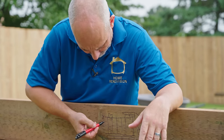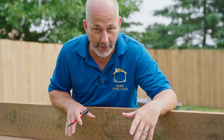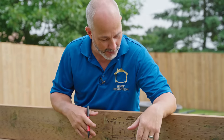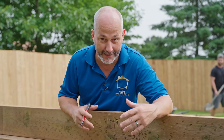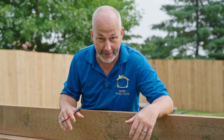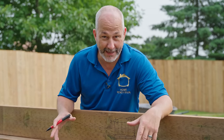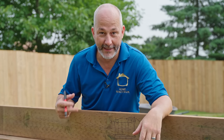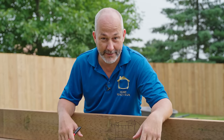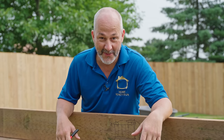What I need to do is cut all of these down to nine foot six so that when we're finished the outside dimension is not bigger than what code allows. If I just start using 2x10s and framing it up, I'm going to have the building a few inches longer than it's allowed. Think back from the beginning and don't do that to yourself — because if you ever get a code officer, that's why they show up. They got a neighbor complaint, he comes out with a measuring tape, and if your shed is 10 foot one inch, well the neighbor's right, it's too big.